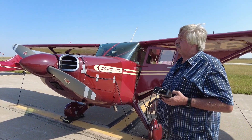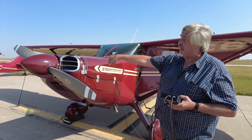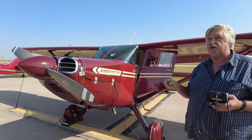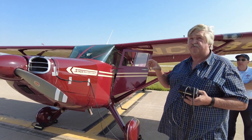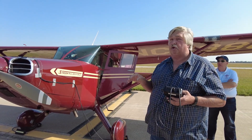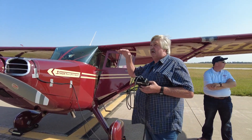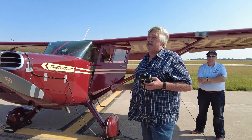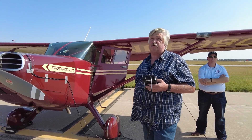By the amount of imbalance, generally on these little airplanes one AN970 washer is about 0.1 IPS — inches per second — which is how we measure the amplitude velocity. The target goal is to get it below 0.2. If you can get it below 0.1, it's really smooth. If you can get it below 0.05, it's like electric motor smooth.